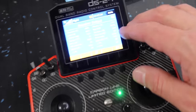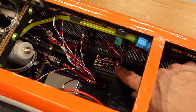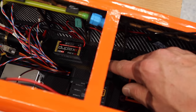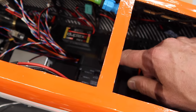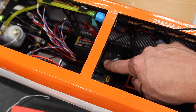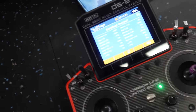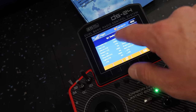When you're setting up the Jeti and Cortex in the manner that we're doing, there's basically going to be an EX bus cable going from port E1 to the Cortex. We're gonna have a secondary power lead coming to the Cortex, and we've got 6 or 7 channels available on the Cortex. Those channels, 1 through 6, need to correspond with the controls in the radio system. Channel 1 is throttle, aileron, flap, flap, aileron, elevator. That's okay, but all of our other channels, rudder, elevator, nose wheel steering, all need to be in the first channels.